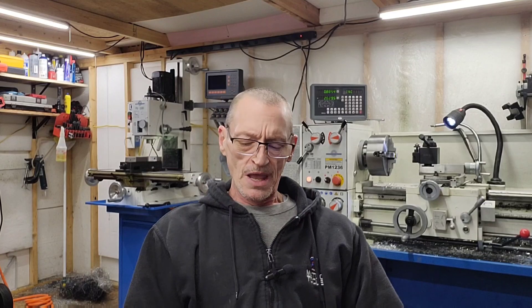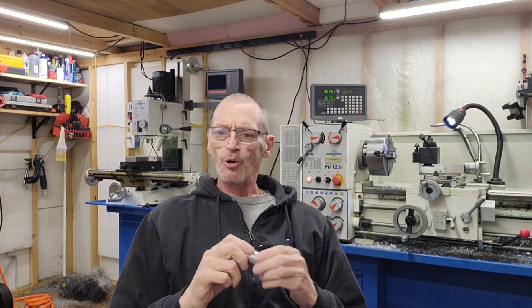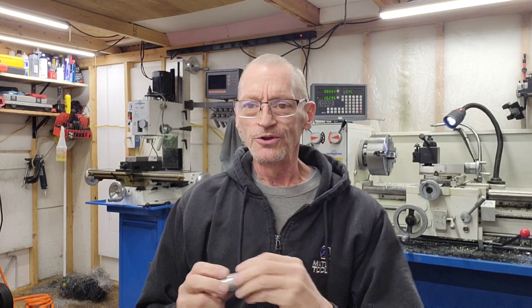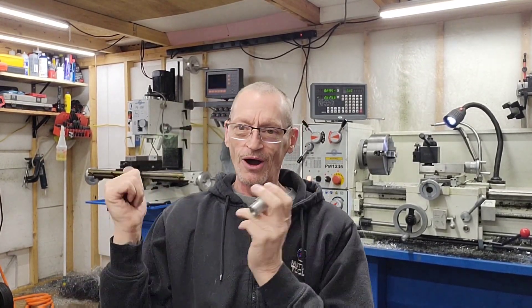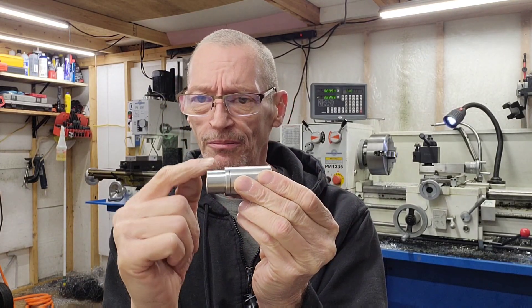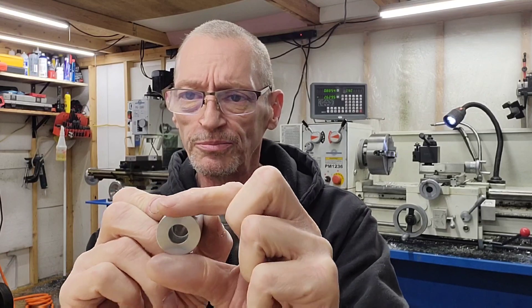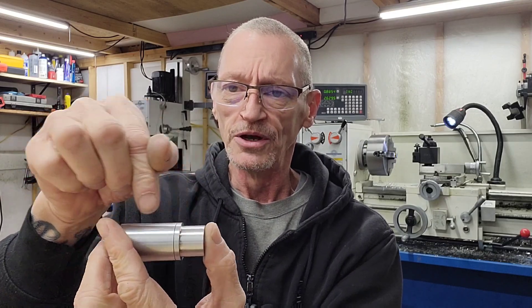Good morning. For anybody who's new to my videos, my name is Jeff. I did a video yesterday on a flash can — doing a flash can for a 10-22 bull barrel. I'm actually going to take one of my bulls, cut the muzzle and thread it for this can. I decided to do some finishing touches, and today I'm going to put a three-quarter or 5/8 hex around the muzzle OD right here, and then put the spanner slots in here for the spanner wrench to tighten down. I might also run a 3/16 flute around the OD of the body.